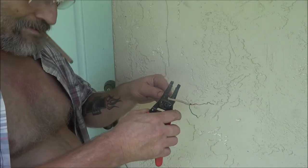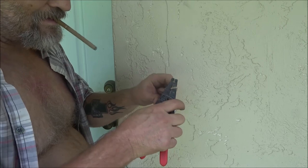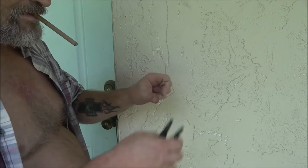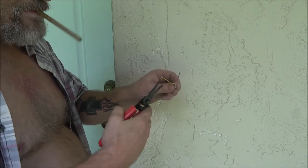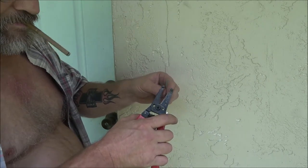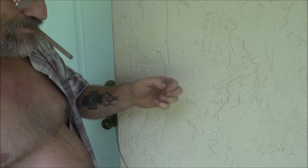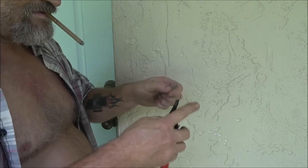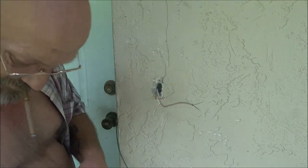This is real simple — we're going to clip this off to expose the wires underneath. I know the ones going to the transformer are green and red, so we're not going to need the black and yellow. I'll go ahead and clip those off. You don't have to tape them because they're not hooked up to anything, though your application may be a little different. There we go — there are those two.